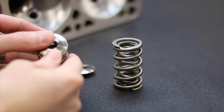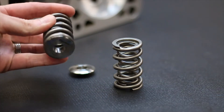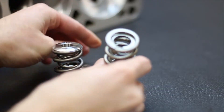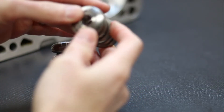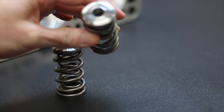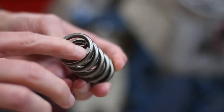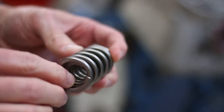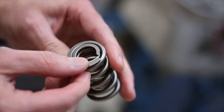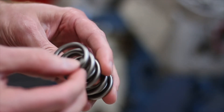There are two key things to look at. One is the press fit — look at the minimum clearance between both sides, which will obviously improve wear on the retainer. The other is dressing the spring. Dressing a spring means the top and bottom of the spring where it was cut off during manufacturing gets chamfered — that edge is rounded off to further reduce wear.